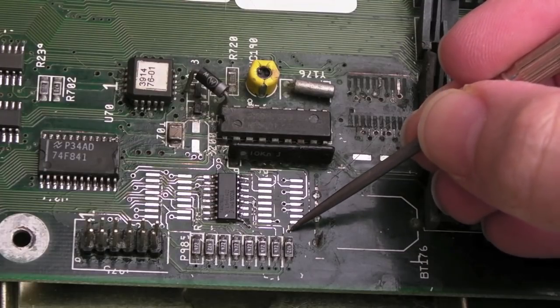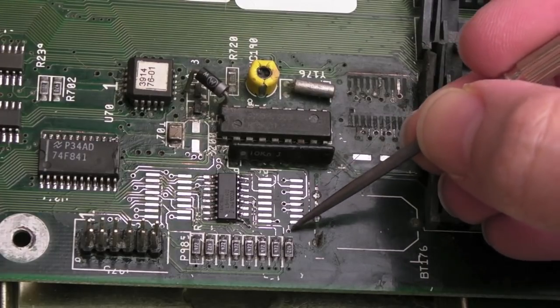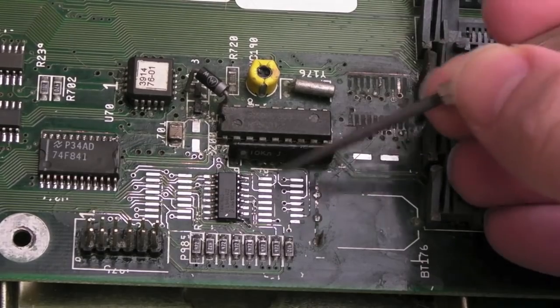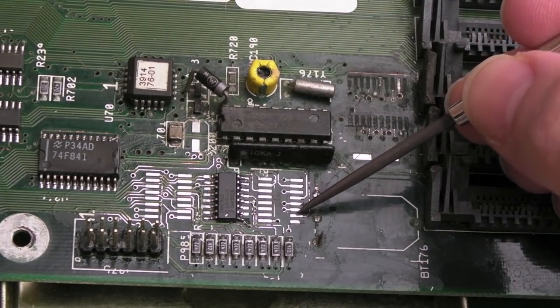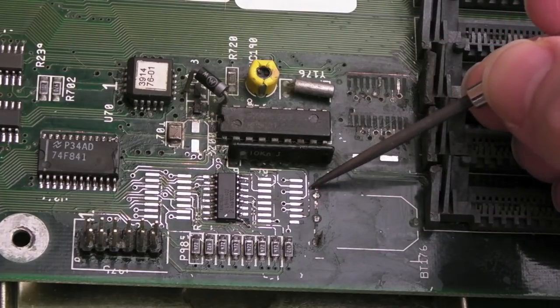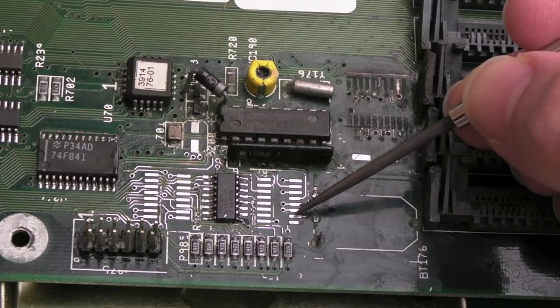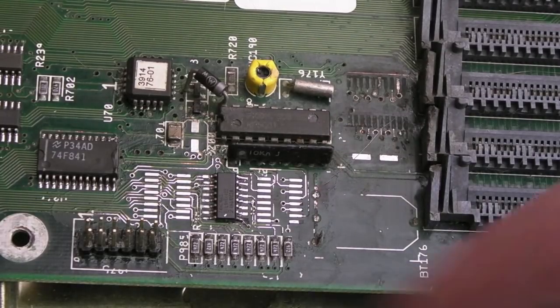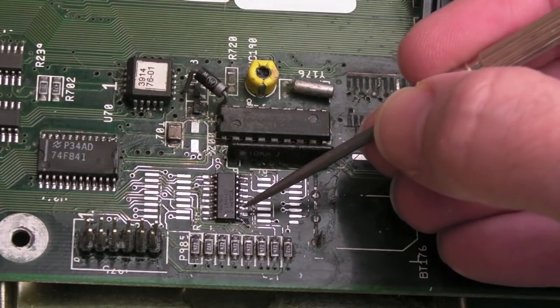The wire here goes to that pad that's broken, so that first connection just needs, when I put the chip on, a little wire soldered here to that wire and pushed through, making sure it's soldered through to the other side. I've checked all the other wires around these on both of these chips, and the second pin here comes up a trace here, which, you can see little bits of it, it's disintegrated. So again, I'll need a wire from here to one of the pins on this resistor pack, but we can deal with that later.